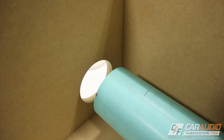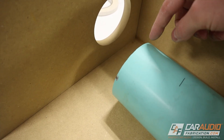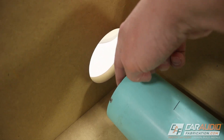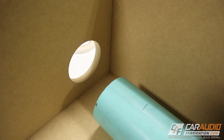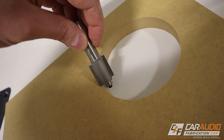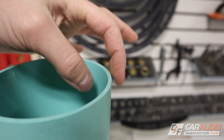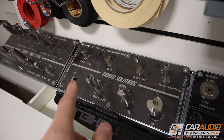This is where people get mixed up — they try to stick the pipe against the hole with adhesive around the outside, or they cut the hole to the outer diameter of the pipe, which makes it hard to seal perfectly. We're going to do something different. The inside of our hole matches the inner diameter of the port, so we need to add a clearance step for the pipe to slide down into. We use a rabbeting bit on the router — flipped over, the bearing rides against the existing hole and cuts a step into the wood. That step needs to match the thickness of the pipe wall, which is one-eighth of an inch in this case. So I've got a one-eighth inch rabbeting bit loaded up.